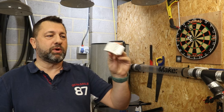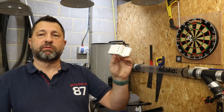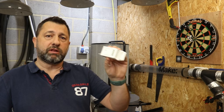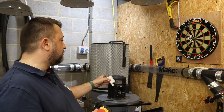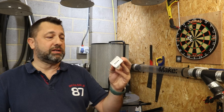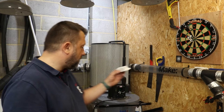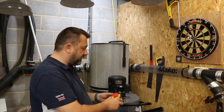What I've found is something by a company called Quintek. It's not actually for dust extraction — it's for lighting. However, this particular unit is rated 16 amps and 3000 watts, and this is a 1500 watt machine. I've tested it, it does the job and it works really well.